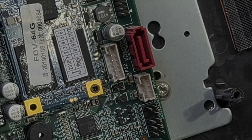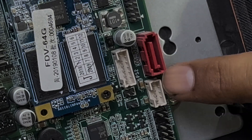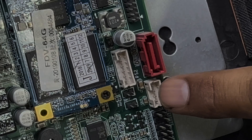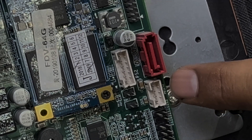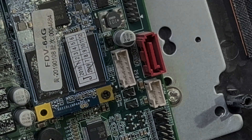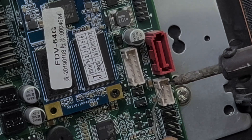There are four pins inside this connector. The top one is 12 volt and the bottom one is 5 volt. The middle two are negative — ground, you can say. I will put a little solder on these connectors so we can connect the cable.